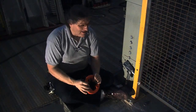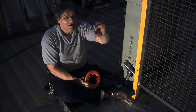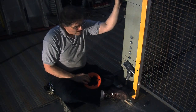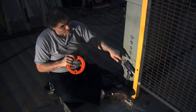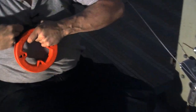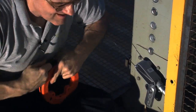What we're doing right now is running the wire through the conduit. We finished running the conduit from the control cabinet with the variac stack all the way to the control switches. To get the wire from there to here, we have to pull it through the conduit using this steel fish tape. I rotate this to pay the fish tape out and insert it down through — it's very stiff so it can make it around the curves in the conduit.